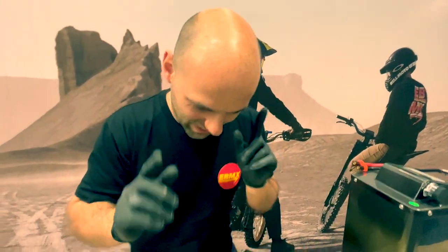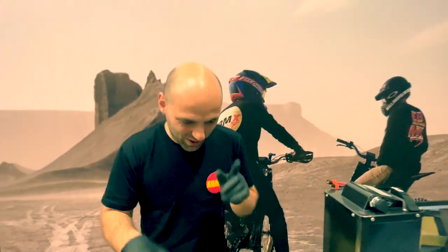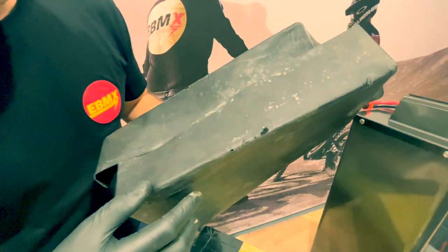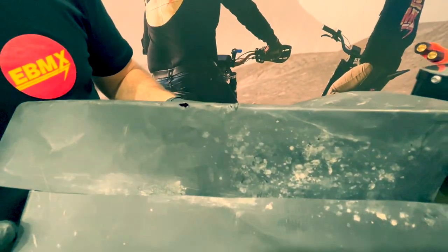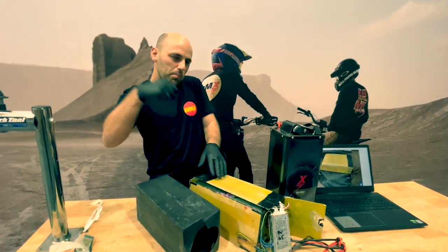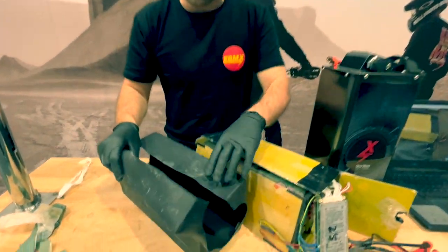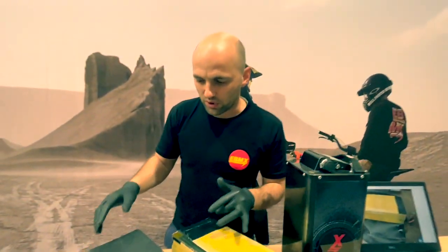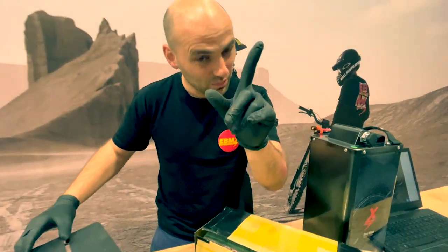Why? We opened it up — I had a good eye for this. We removed it from the bike and found a pinched hole here, another pinched hole here, another one, another one, another one — multiple holes. Every time you get the battery in and out, yeah, a little bump here. You know, you dig a little hole there. And then you wash your bike, you take the bike off-road, and then... what happens?